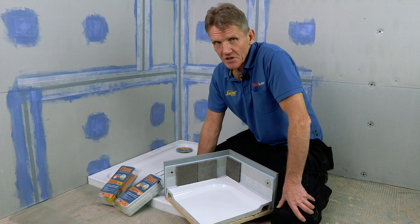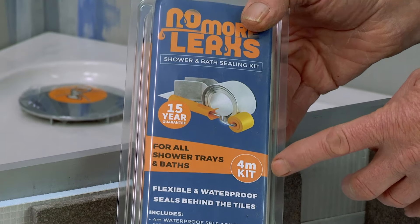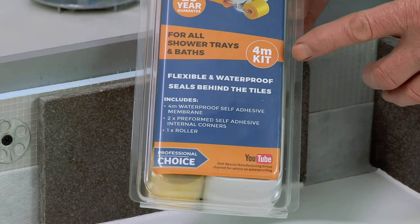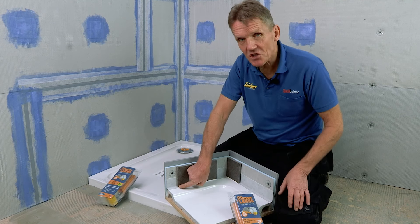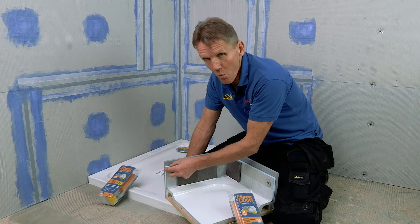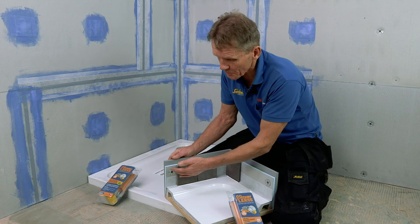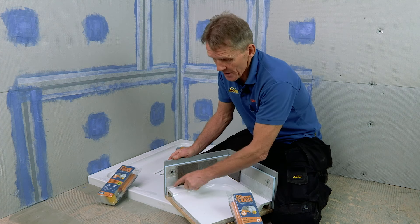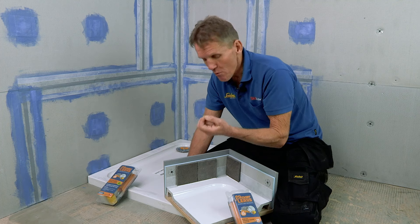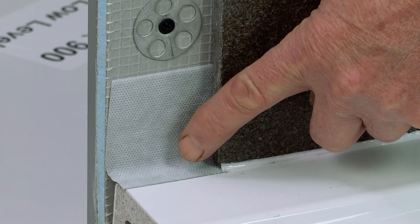You'd think there would be a solution in this day and age, and there is — it's called No More Leaks sealant tape. This isn't just a solution that's going to last a couple of years; it has a 15-year guarantee, and I fully expect this waterproof tape to last a lot longer than that. The idea is that instead of forming a seal along the front, the tape is applied behind the tiles onto the substructure. Applied there and down onto the shower tray or bath itself, you form an absolutely foolproof permanent seal, so if any water creeps past that silicone seal it can't get any further.